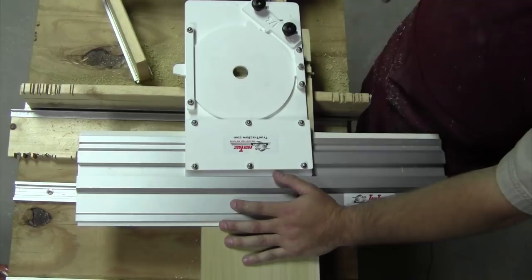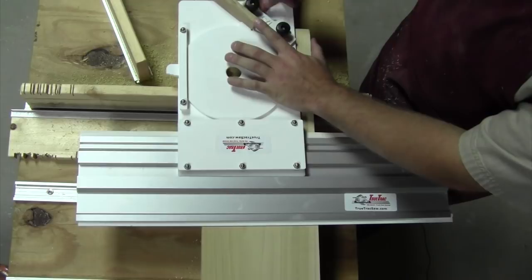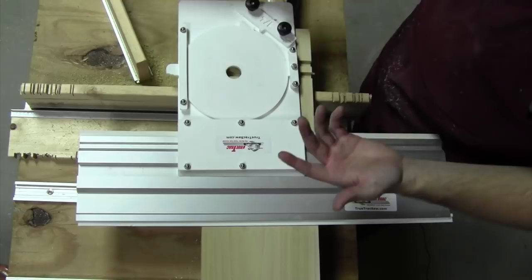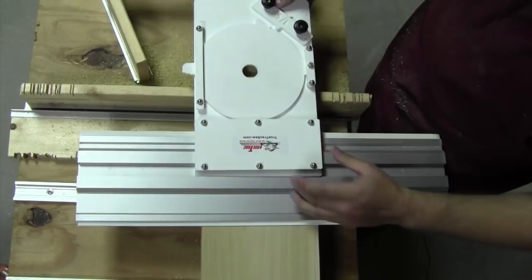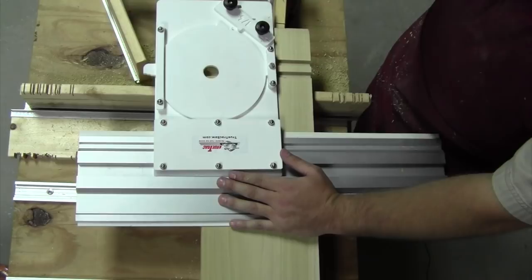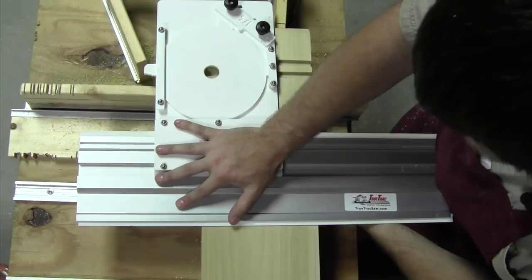It's always a good idea to slide the piece of wood back in to make sure you're getting a nice snug fit. If you're making a sliding door for a cabinet, you'd slide the wood in, close the measurement block behind it, then pivot the measurement plate out until there's a visible gap between the back of the wood and the block — tighten it down, and you know it's going to be a loose dado. And that's how the dado jig works on the TrueTrack system: easy, accurate, and flexible enough to use the tools you already have.